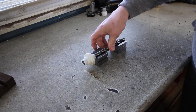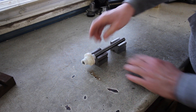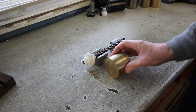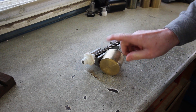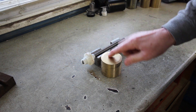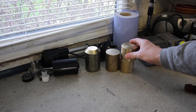This is the stripped gear out of my linear actuator, so I'm going to make another one out of ali bronze. Why ali bronze? Because that was all my local scrap metal merchant had in stock. I was going to use brass, but they haven't got any brass big enough, so ali bronze it is. I've got enough.